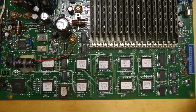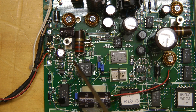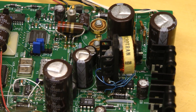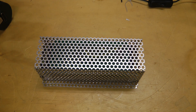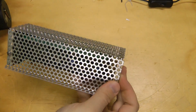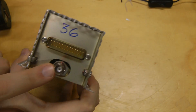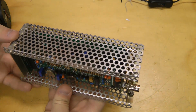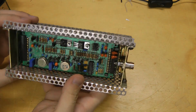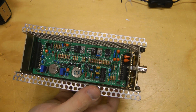There's also a lot of bodge wires all over this thing, especially around this video output area — there's numerous bodges and components added and all sorts of things. And even more bodginess on this regulator. This appears to be the CCD driver. This end connects over to the CCD camera. There are three horizontal boards and two vertical boards, one at each end. This appears to be the actual video output, probably containing the drive electronics for the CCD clocks and amplifiers for the weak video output.